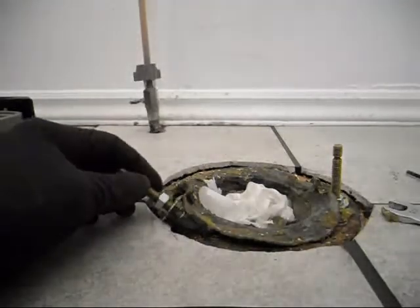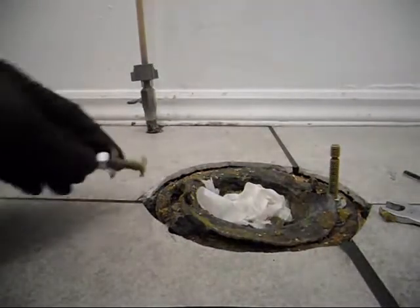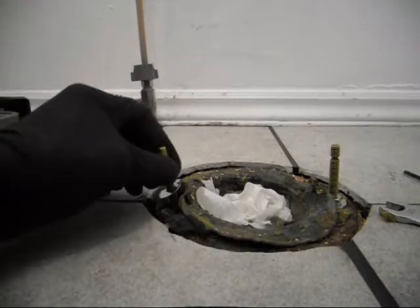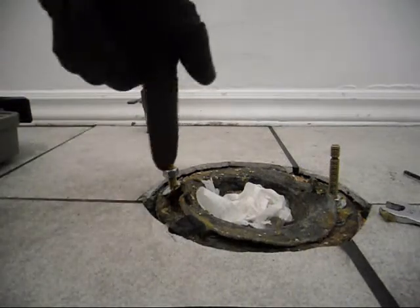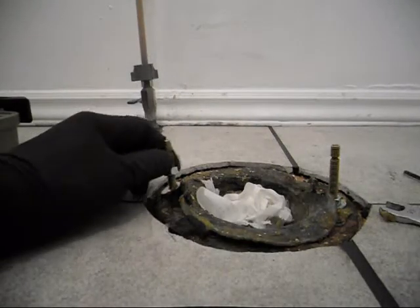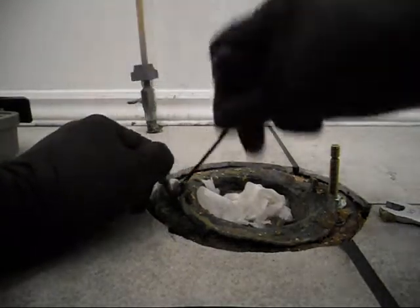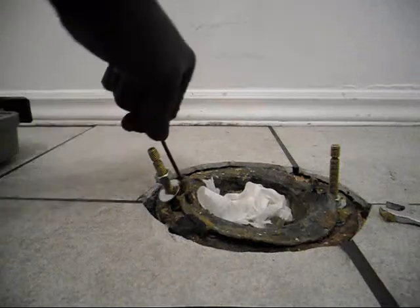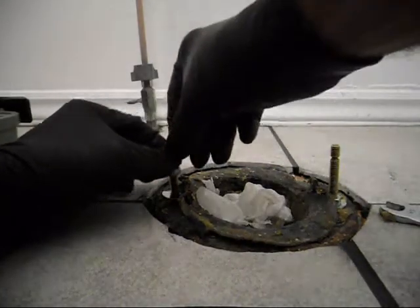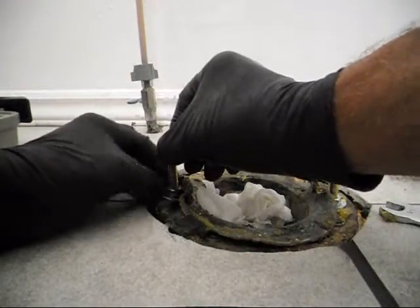Just went to the plumbing supply and they gave me this new gizmo that you lock a nut into this flange, you tighten the nut into the flange, then you bolt down into the nut as opposed to the stud sticking up. Selling like crazy. Somebody had a new idea for a toilet flange bolt. I bought some, but I didn't try it. I like this system because you can locate the toilet by the studs as opposed to guessing where the nuts are. So I'm looking at my line on the top.